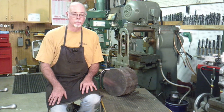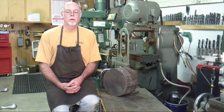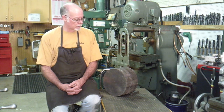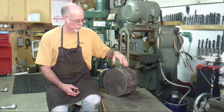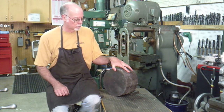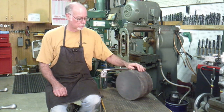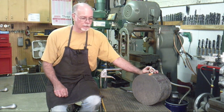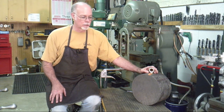It's going to involve a little bit of lathe work to start off with. And thinking forward going through this project, I can already see a couple challenges with it. The first one is simply how to put this thing onto the lathe, because normally you grab something and pick it up. Every time I try to grab this, it slips out of my fingers. And if I grab it this way and mount it up against the chuck, well, I'll probably smash my thumb or something like that. So I was thinking about this a little, but looking at the material, I got lucky. I found out it had an eye bolt in it, and I'm going to be able to use that eye bolt to get a little better grip on this. So I'm going to take this over to the lathe and chuck it up.